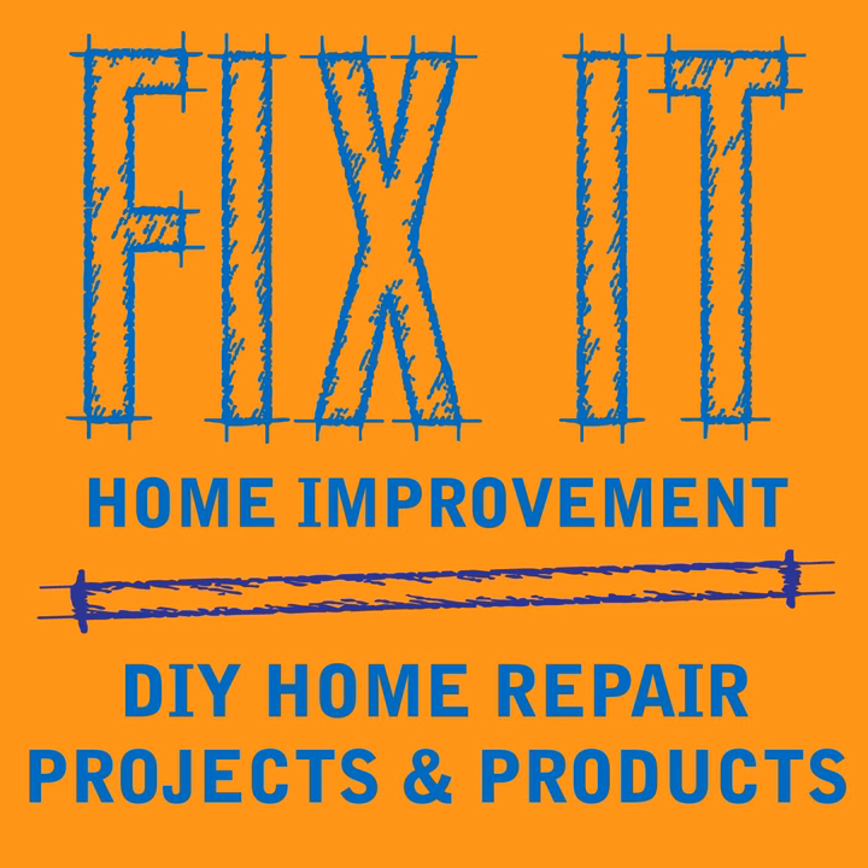I use it primarily for trimming laminates for countertops. In my last house I decided to spray paint the old kitchen cabinets and cover the countertops with new laminate until I had the time and money to replace everything. I bought rolls of laminate, measured and cut the excess to cover the edges and backsplash. I removed the sink, sanded the old countertop, and used contact adhesive. With the router on top, I used a laminate bit with a bearing to guide it for an exact flush cut, pushing counterclockwise around the outside and clockwise for the sink hole on the inside.